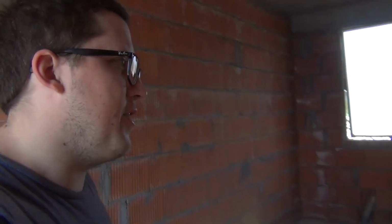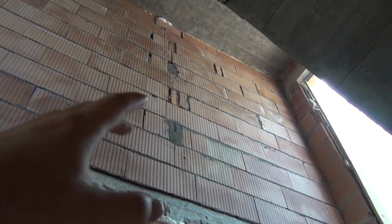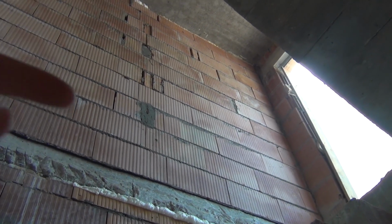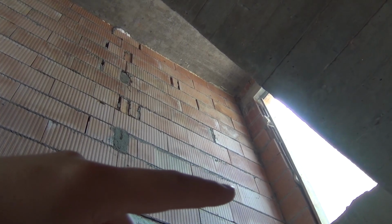We're in the mudroom. This is where I started off. If you haven't seen it, I bought a new angle grinder. You can look up, I'm going to leave a link somewhere to that video. We're going to be using it today to cut these walls, but some of these walls are pretty long spans, especially that one on the top, and it's not held by anything really except those puny bars sticking into drilled holes, not really tied in with any mortar over there. So we're going to take those bricks out and tie them properly so that it doesn't fall on anybody, or shift and crack or whatever can happen. Better do this now before we put in the finish on the walls and just have it over with, get it done, right? Alright, let's get to work.